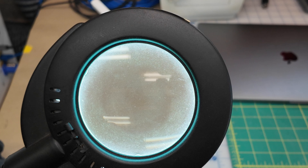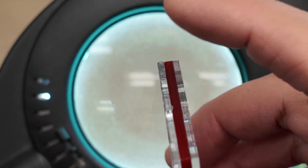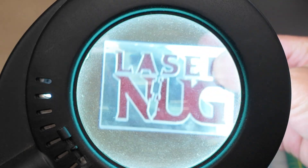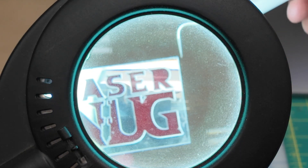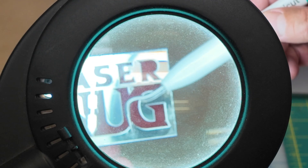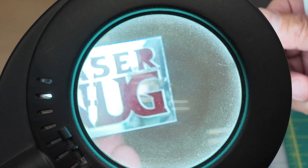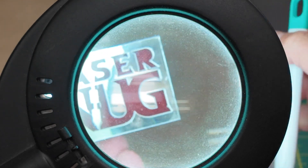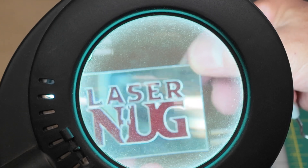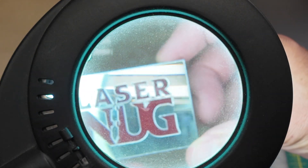I'm going to use the magnifying glass because I don't think you'll be able to see it on the naked camera alone. On this first piece I have a red piece of acrylic in the middle and I've used both sides of it — on one side I glued it, on the other side I used 3M adhesive. On the side where I used number 16 cement to cement the mirrored acrylic to the red acrylic, you can see it almost breaks down that grey mirrored coating on the back — it kind of bubbles. Conclusion: don't use number 16 cement. On the back where I used 3M adhesive, it's clean all the way through — the 3M adhesive is the way to go.